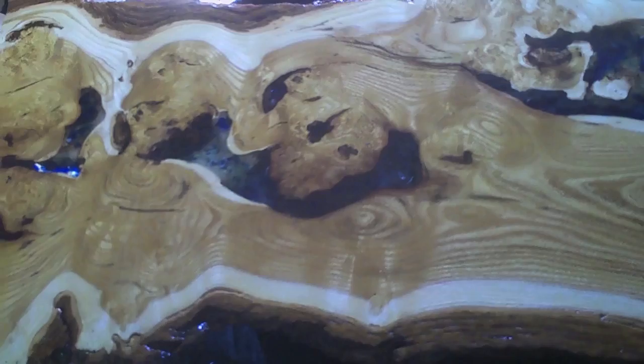Keep in mind you'll have about half as much work time if you microwave it. Most of the bubbles in this instance are escaping out of the wood fibers themselves — the epoxy soaks in and the air has got to go somewhere, so it comes up. Because this is the top side and I care about the bubbles, I'll probably come back up here three more times.